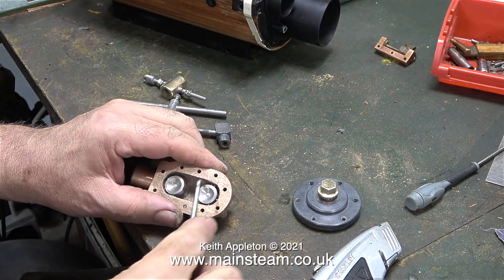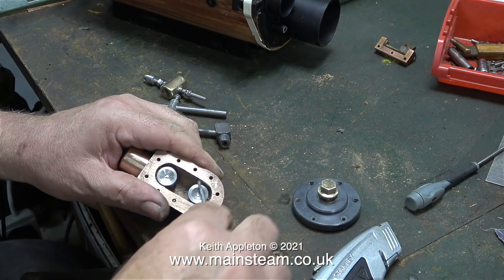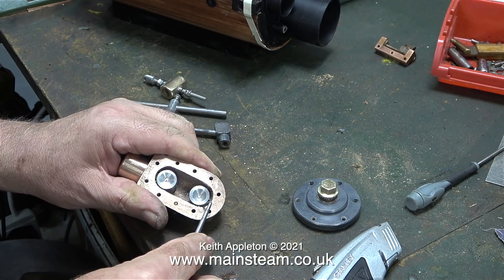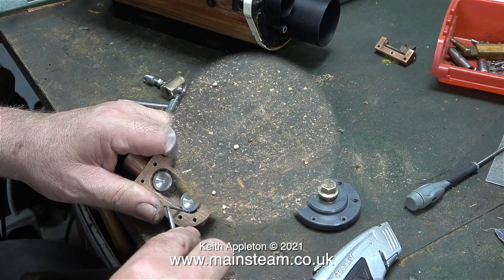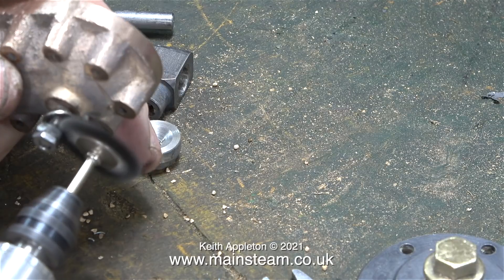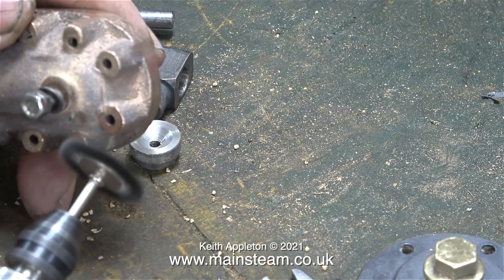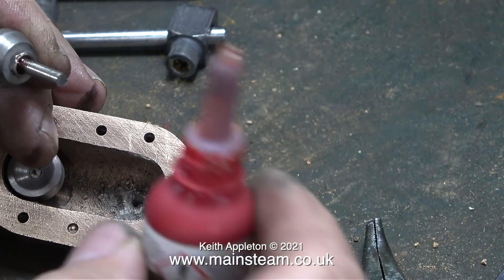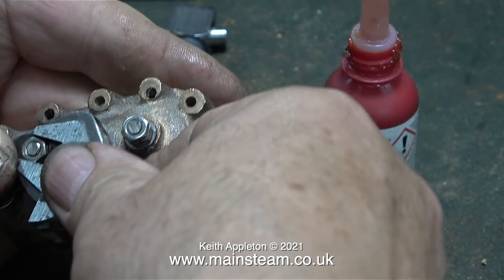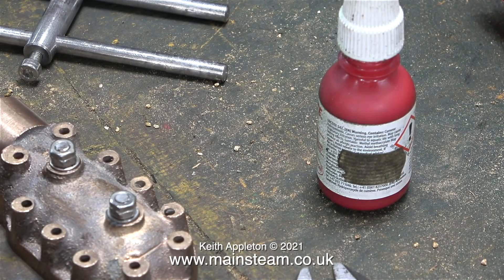To reinforce my warning about putting certain things in a tumbler polisher: you can clearly see that all the media is stuck around the edge of these valve lift limiters. I'm going to take them out — I was going to loosen everything up to get rid of the silicone rubber stuff anyway. Here I'm doing just that, using a Proxxon motor tool with a wire brush. Before reassembly I'm applying a very small amount of Loctite 542, which will seal the thread in the hole. Once I've fitted both of these ball lift limiters, again using a small amount of Loctite 542, I've tightened up the lock nuts.